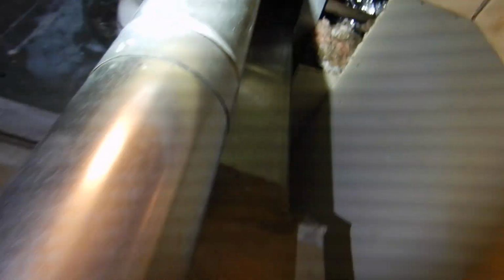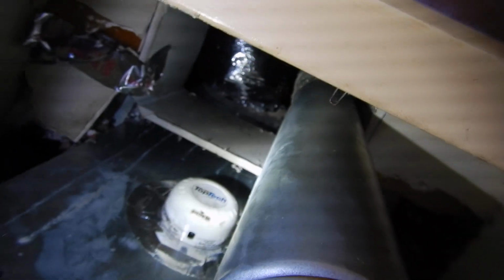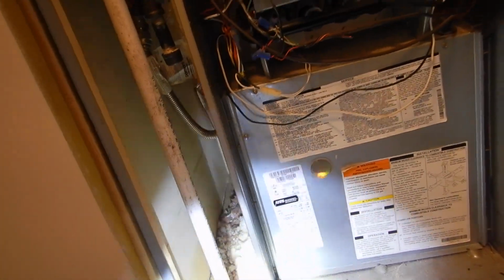So this is our furnace. It goes up through the roof, and we got another opening up there. But what we do not have is an escutcheon plate. It's called a thimble. We do not have a thimble on our flue. It's like a pie pan up there, and then the roof would be closed up, and then have the vents. Let's say that this vent is, for the time being, acceptable. But then this vent, we should have makeup air, and it comes down to about 6 inches from the floor.